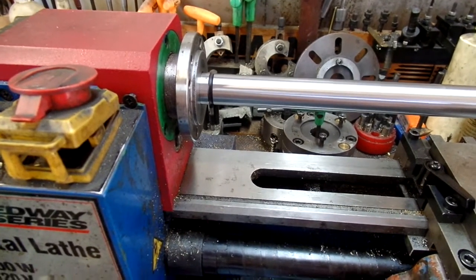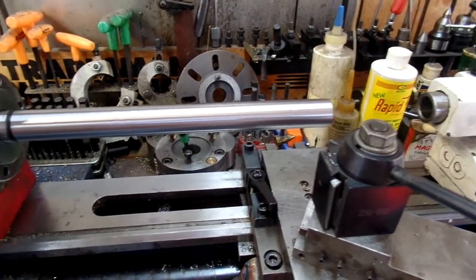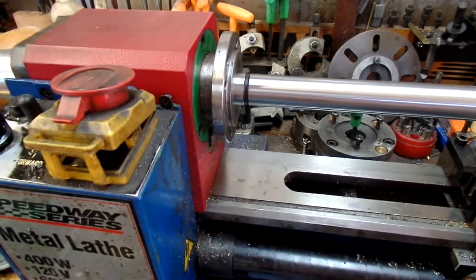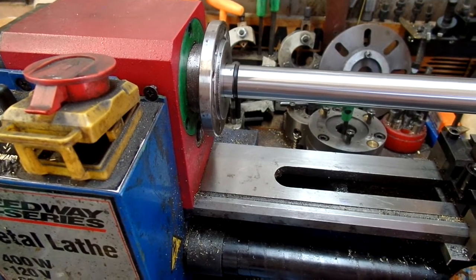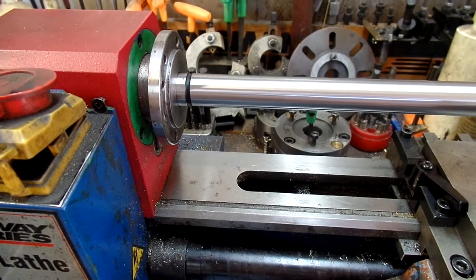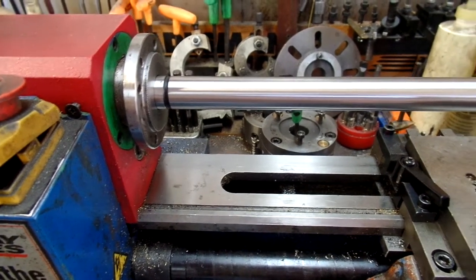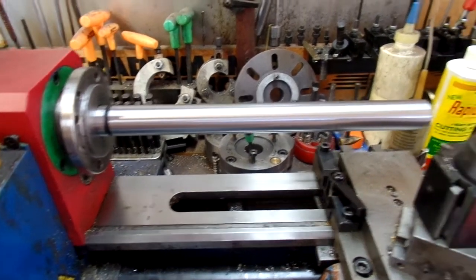I've been reading the talk about using a laser to line up a lathe. I really don't think that's a good idea. The main problem is measuring the size of the laser spot accurately and finding center with the spot. The laser, in my opinion, would only be worthwhile in the crudest sort of way.